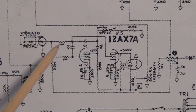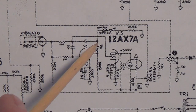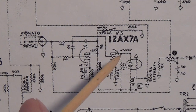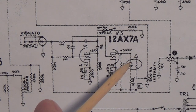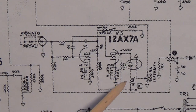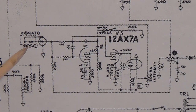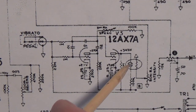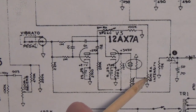If you turn on the tremolo, let's take a look at this section of the circuit and compare it to the diagram shown at the beginning of the video. You can see we have essentially an identical phase shift oscillator right here. Then, as predicted, we're going to send signal from the loop over to the grid of the second half of a 12AX7, come out of the plate and go into our neon bulb — shown as two D's back-to-back — then down through what amounts to a plate resistor, and to our B+. We have our standard speed control and foot pedal, just as in the first video. The neon light is flashing over here at the photoresistor, with one end to ground and the other to the 50K pot, just as described.